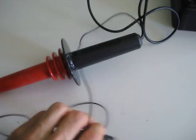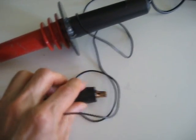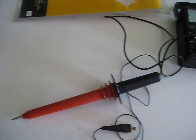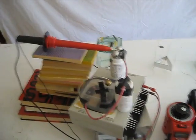The other thing coming out of here is this ground wire which has this ground clip. Electrically, the ground banana plug is connected to the same point that this ground clip is inside here. So that means this is in fact grounded as long as this is grounded. And I guess the purpose for that is so that A it has a ground reference, and B so that if there's a short inside it'll go to ground instead of going to the meter.